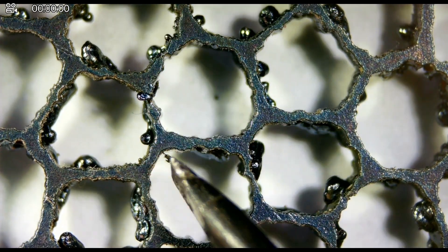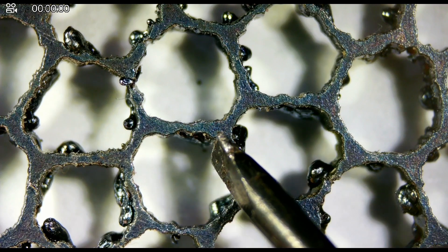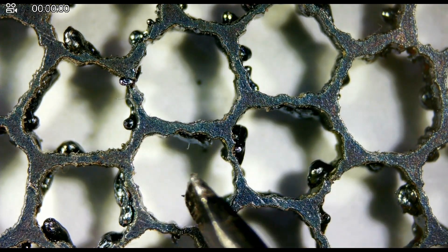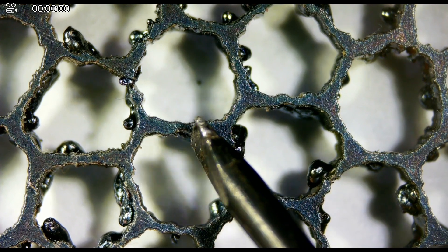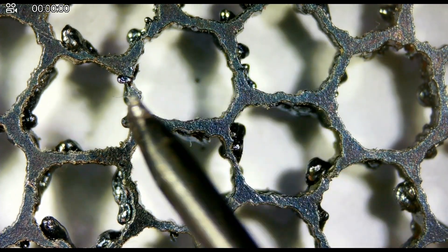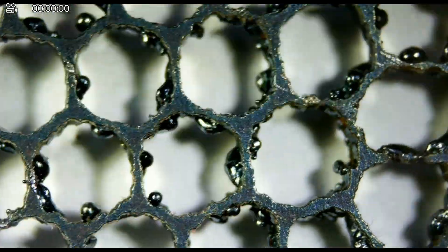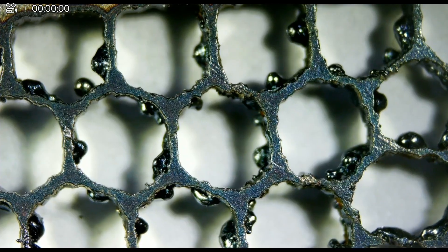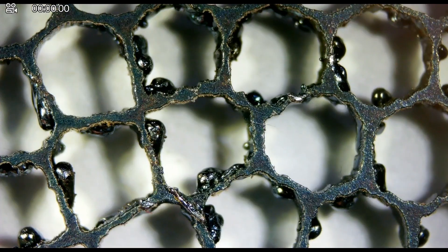At 40 inches per minute, I'm getting a lot of ringing at these cuts. It's probably ringing the whole time, but this distance from here to here is about two and a half millimeters, which is pretty small. So 40 inches per minute at this size is even too fast. But it made it through and there's very little burnout. I don't see any on this one — it looks like all the bridges are intact.